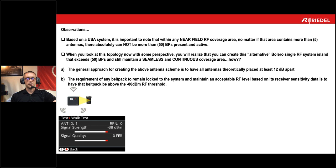That's just the receiver desense that most RF equipment experiences. Has anybody ever used a pizza pan or anything like that to sort of direct the signal? No, that's been a popular tool. I've seen some older RTS systems use that theory, and a couple of old ClearCom systems use that theory about trying to redirect energy. But again, that's using a very archaic codec. The RF filtering in this codec is so advanced that you don't need those tools. You don't need to play those games.